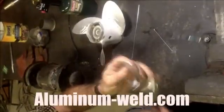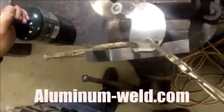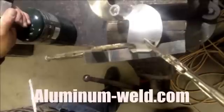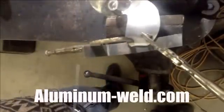I'm going to do that same repair on this little trolling motor prop — it's die cast aluminum. First I'm going to clean it up on this grinder and then we'll proceed. Now I've cleaned my prop; even brand new aluminum is dirty so make sure you get it clean. I clamped a piece of steel here — we're going to get it hot up to 735 degrees and fill this whole area full of rod, and then we'll machine it off.